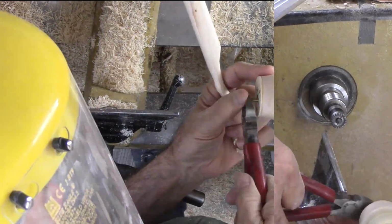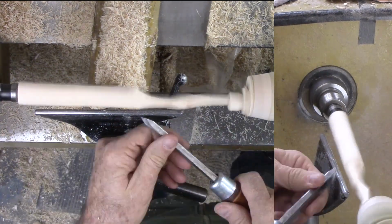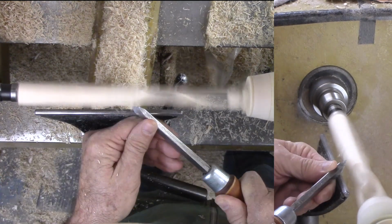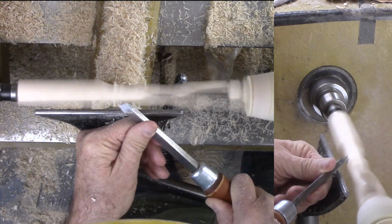With the shift to the third offset hole, I am still extremely careful with very light tool pressure and minimal live center pressure. Amazingly, the wood survives. Note to self: use both faceplates next time.